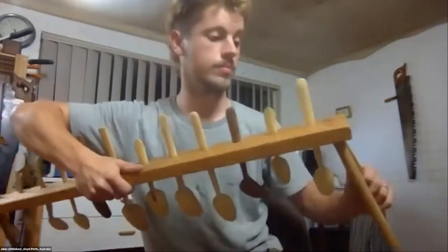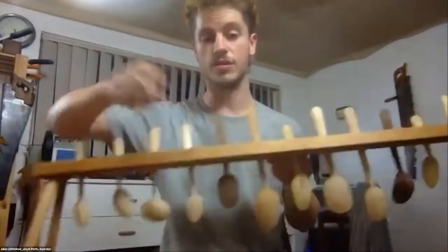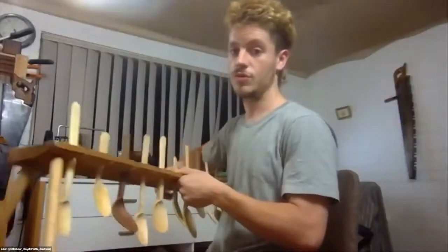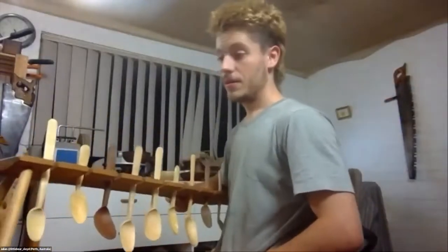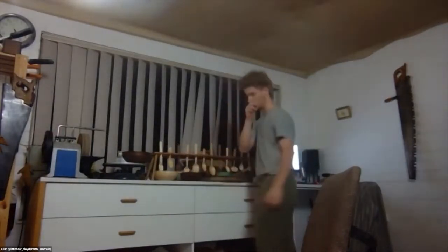So some of these I've actually glued in place. There's no real need to pack it in because it's small enough anyway. So I would have no hesitation to just use glue. Yeah, that's what I did. And like I said, if you've got a tapered tenon cutter and reamer, use it because it's perfect for this application. But even just the slight amount of spread that you get from just the small wedge in your saw kerf seems brilliant. Yeah, totally.